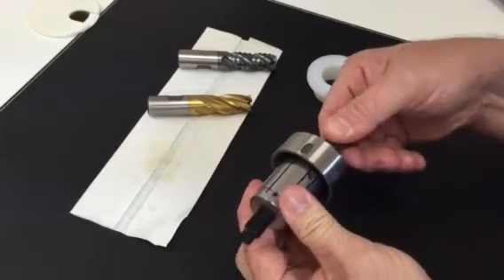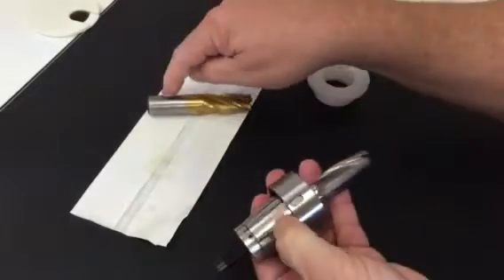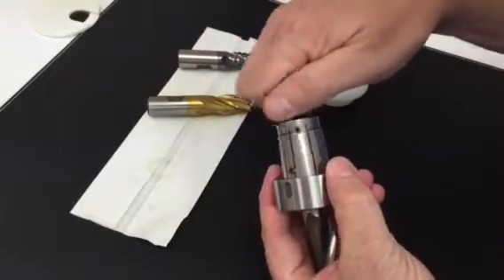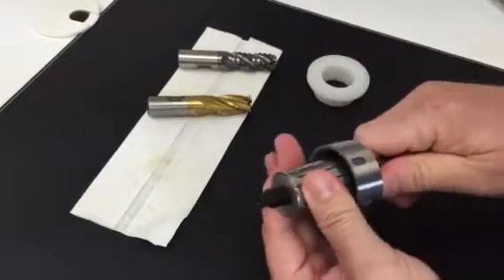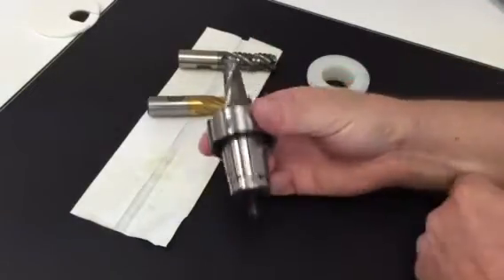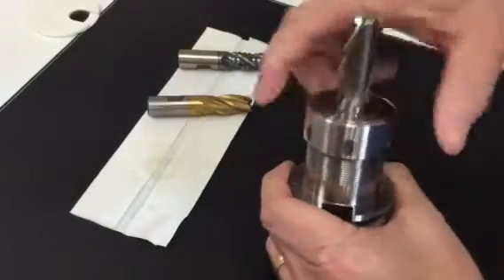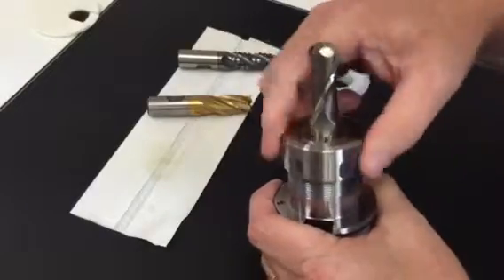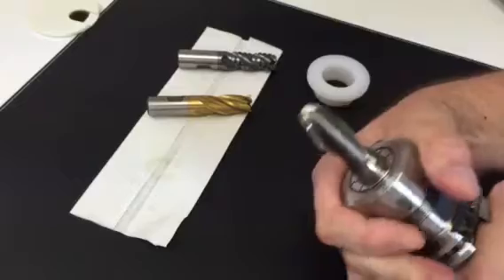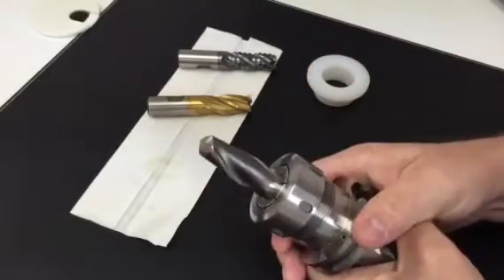If we pull out on our end mill, we take out the Z that's in it, so it's tight up against the angle there. Then all we do is hand tighten this down just to take out any z-play in the assembly. And basically that's it. We take this, put it in our collet chuck, and use our wrench and tighten it down. There's no play in it — we tighten it down, and that'll grip it and give it its holding power.